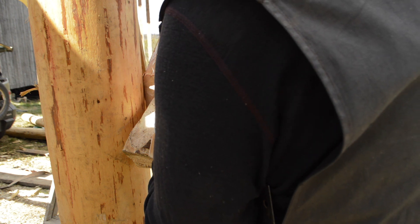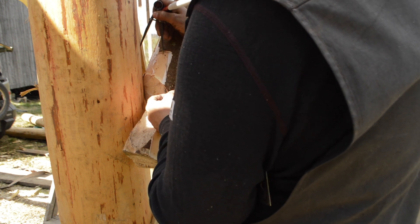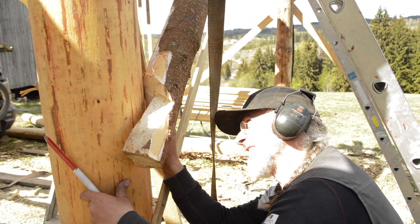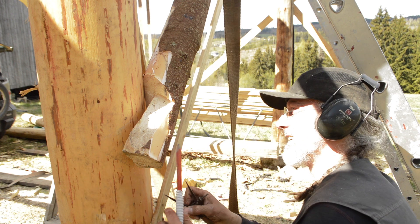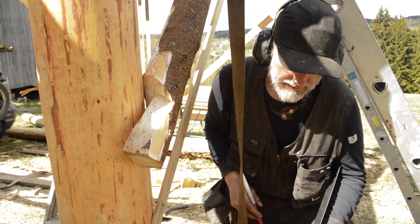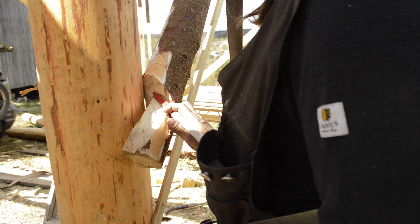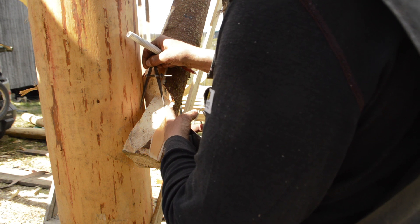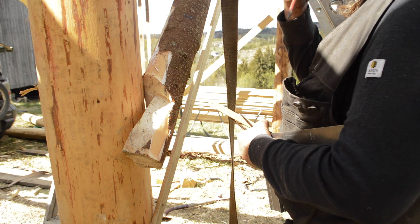I can't really see anything because it's fresh timber. I'm going to just put dots in because it's too fresh. I'm going to go to the edge to see the pencil, and that can also go underneath as well. I'll cut a bit of that away — this is going to go, that's going to go. I'll carry that line into the edge there and cut this in here, about four centimeters deep. Five maybe — about five centimeters deep. Now I'm going to do the same thing at the top.